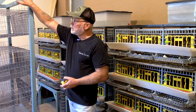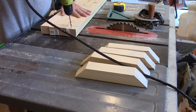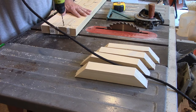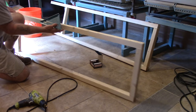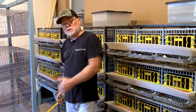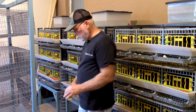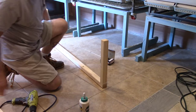I'll go ahead and do the top bar piece first and then the bottom rail. When you're pre-drilling the holes on the legs, the top hole has to split a 2x2. The bottom hole is going to be located at 16 inches from the floor. That will put your bottom manure tray 16 inches off the floor and give you plenty of room underneath the cage for storing stuff. Screw your top piece in first and then your bottom piece.